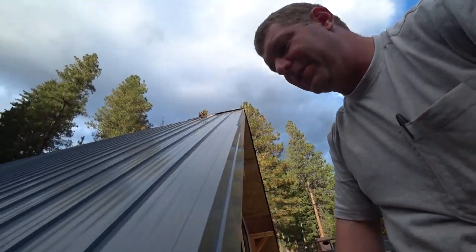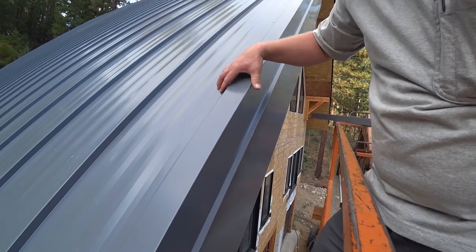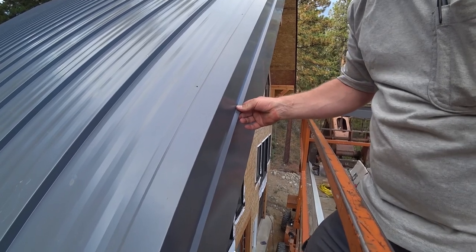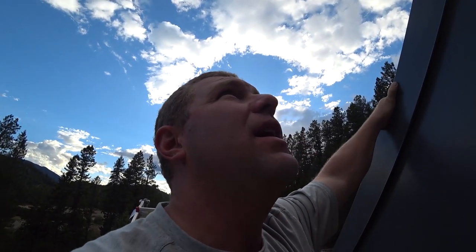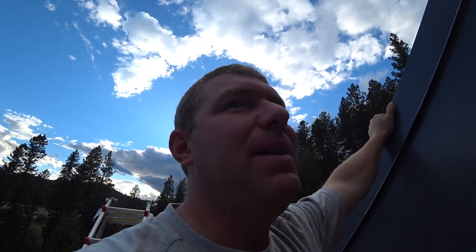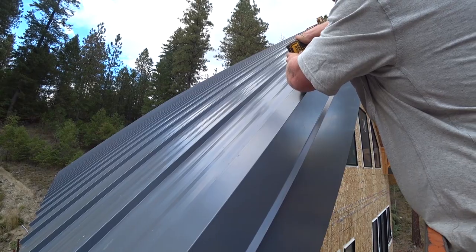Basically, all we'll have to do is put the cladding on, get that correct, and then basically set the step rake down onto the double bead mastic, punch a screw in here, find where it's happy on the eave, and then punch a screw in and hold it tight. In the interest of making sure I don't miss the electrician, because their time is hard to come by, I think I'm just gonna punch a screw in here and we're just gonna leave this for now. And then maybe hopefully, tomorrow, get up here and start making some headway on this guy.